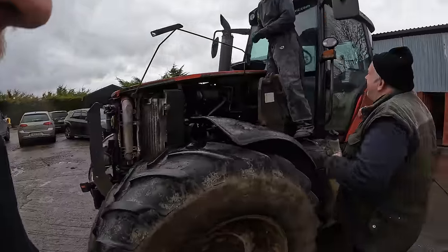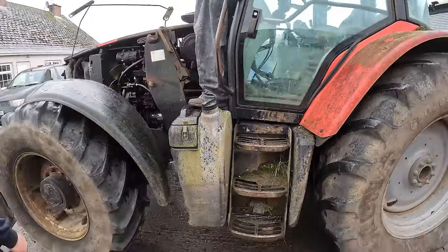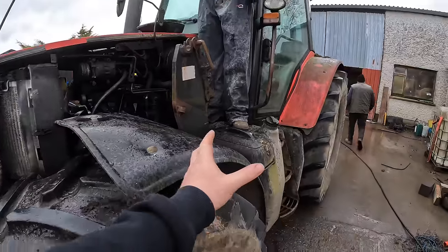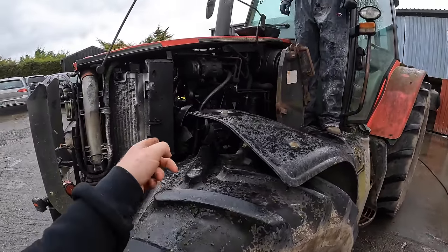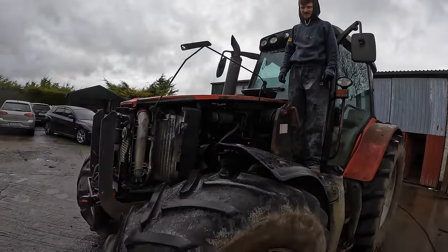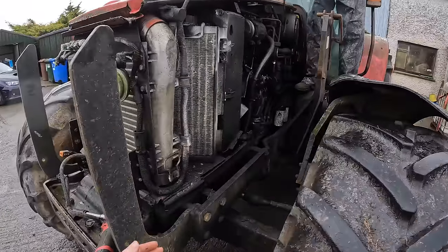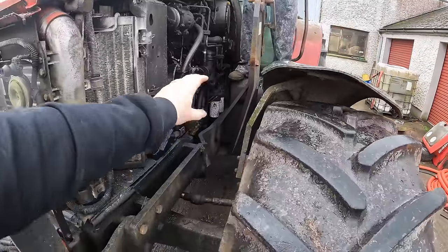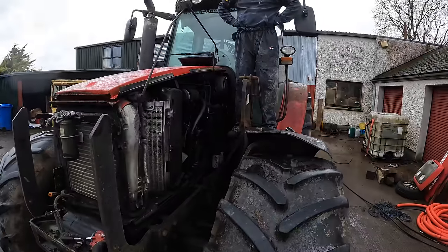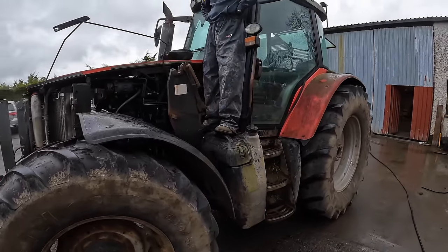So the damper plate is basically in there. You would have seen an old video of us changing one on a 6270, so it's the same job here. While we're in that far, because the whole tractor has to be split front from back, we'll hopefully try and get the crankshaft seal done and maybe the pump. We'll just send it away. But it's a big job to do this, because this has loader brackets. It's not only tied front to back with its own bolts, but it's also tied with the loader bracket front to back. And the diesel tank has to come off too, doesn't it? You don't know yet. We do have rails for splitting and everything, but it's just a big job.